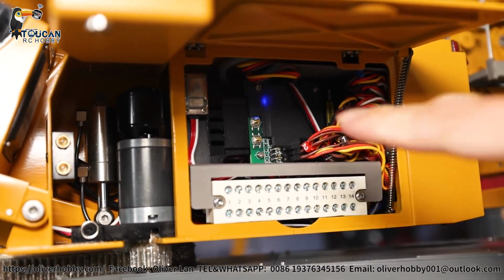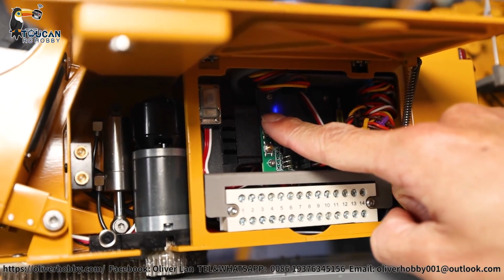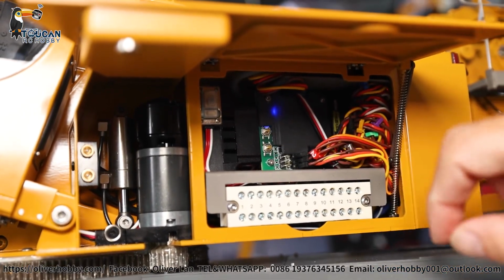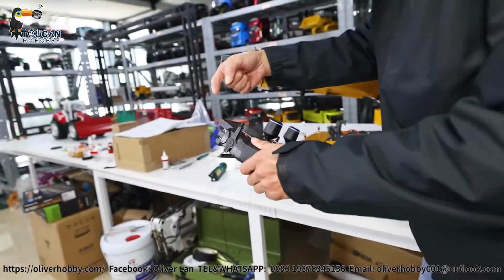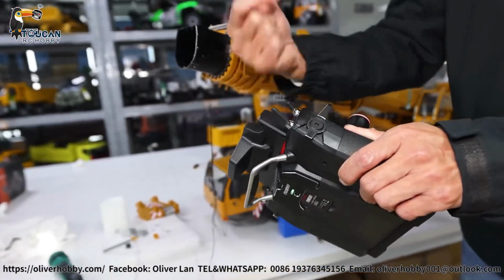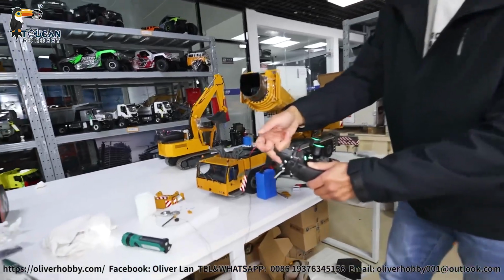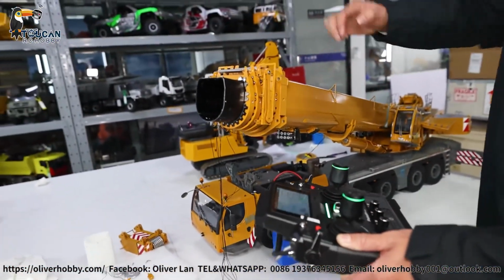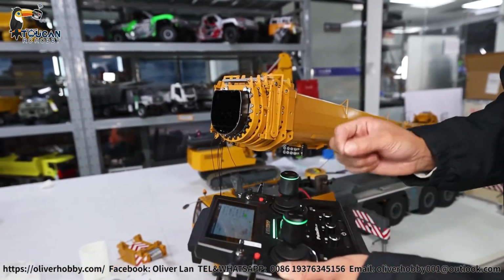Calibrating number 5 point to check if correct. Flashing 1, 2, 3, 4, 5. It's okay. Again, 1, 2, 3, 4, 5. Okay, that's number 5 point. Let's calibrate it. So now you just withdraw back the boom manually. Yeah, now it's not starting. Only you start the pump directly. Back, start the pump. It will move back until the end, touching the rear side end. Then you stop. Okay, already stop.